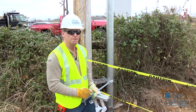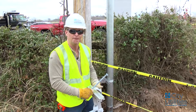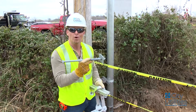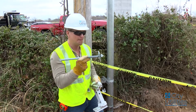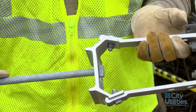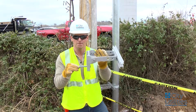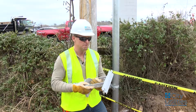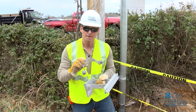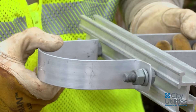What I have here behind me is the four inch standoff on the pole, and what I'm holding is the four inch standoff. Whenever you go to pick up all of your pieces and parts, someone doing this job will come out and deliver whatever bolt you need to attach to our pole — you'll be getting some type of through bolt. Plan on having a drill that can drill through our pole. This through bolt goes through the pole, and then this bolt will be nailed to the pole on the bottom to help keep it secure so it's not going to be moving around. On the end of this, as you can see, there is an aluminum bracket that goes around the face. It holds the four inch galvanized, but these can also be up to six inches as well. It's really simple — just loosen up these bolts, it's a channel, slide it right on through, and tighten it up.